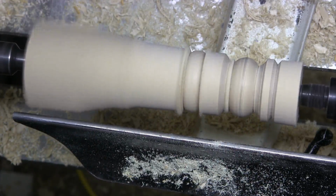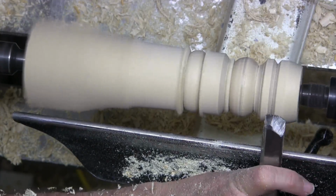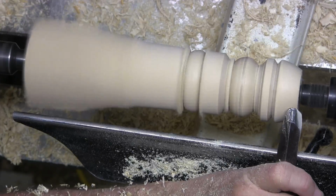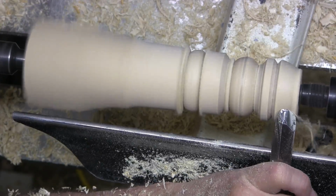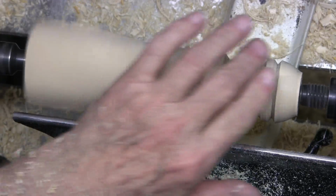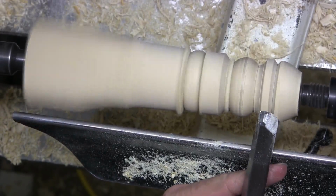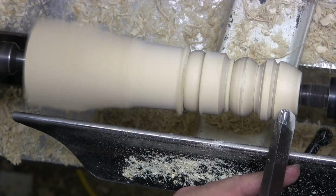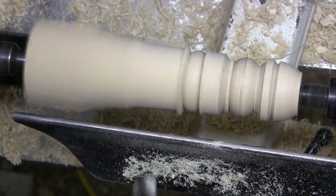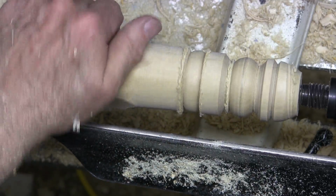But it gives you more control, because here's the problem with the rolling cut if you try to do it. This is not using the point in the wood. Beautiful finish, though. Look at the shavings that are coming off. When you see those kind of screw noodles, you know it's a good cut. And it just polishes off the end grain beautifully. But here's the problem. It's very easy to get this. Mark of Zorro, we call that. Like that. That look familiar?